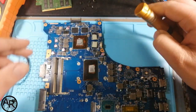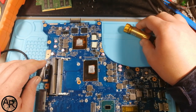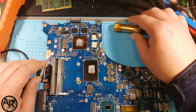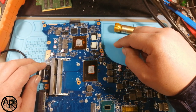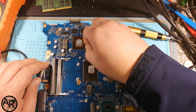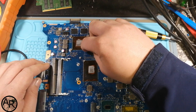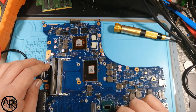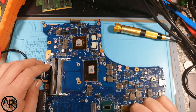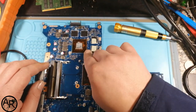Take out the RAM. Alright, so that should be it for now. I'll show you how I remove the PCH, do maybe some time-lapse video on that. You're going to need to remove this edge bonding they've got on here. I need to solder that back onto the board.